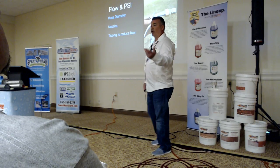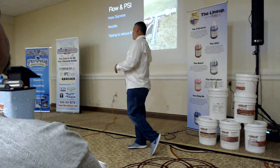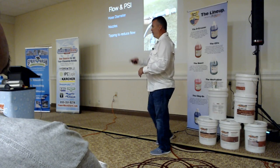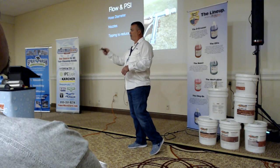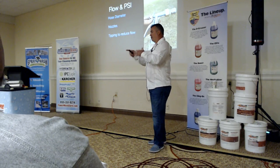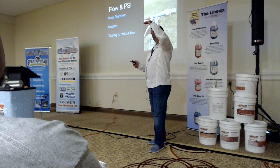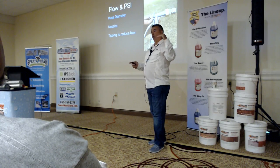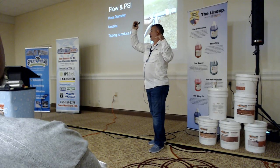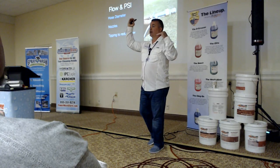Again, we had the flow meter out there and the PSI gauge out there. And we talked about 5 GPM. Well, that pump is a 5 GPM Gould's 3/4 horse right there. 5 is the optimum GPM. It can flow 1 to 8, and probably go higher than 8 if you supply it with a dang good water supply on positive water.